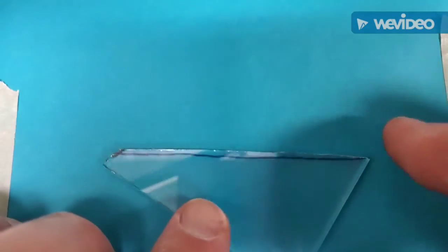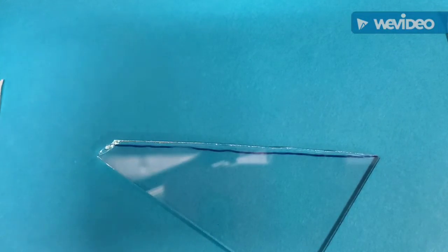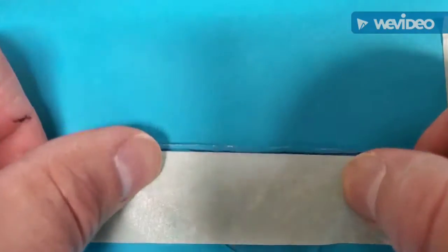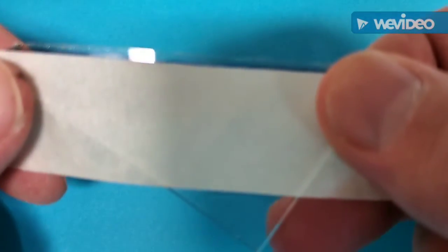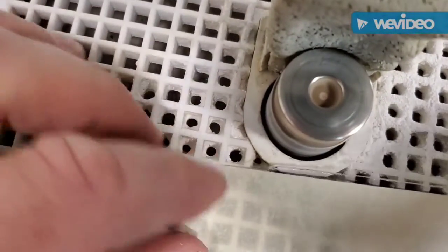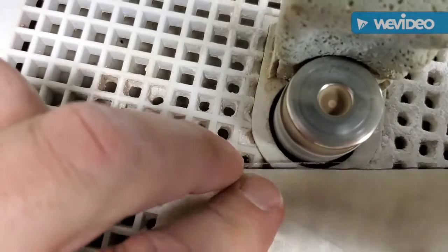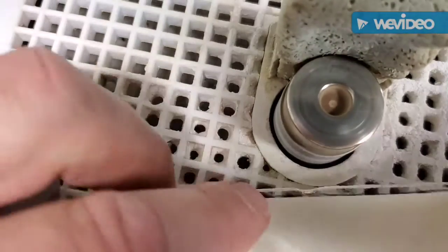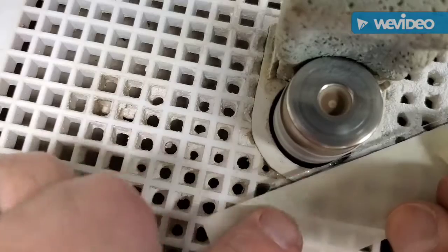Here's a piece of glass that I need to grind down to a line. This helps a lot — I'd recommend any time you're doing a straight line, take a piece of tape and lay it on your glass right on that line, and then all you're doing is grinding the glass down to the tape. So I put the tape on there and I'm going to grind that down. When you do a straight line, you're going to sweep it along here — don't just hit one spot, because if you hit one spot you're going to get a dent. Always move it like this and sweep it along the line.